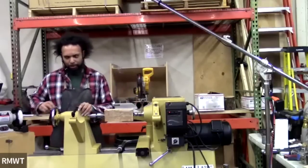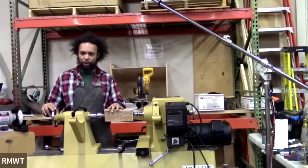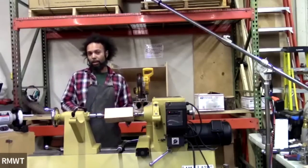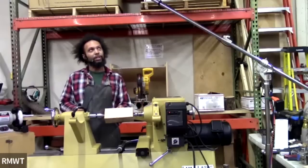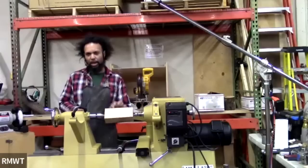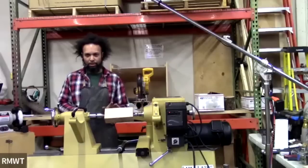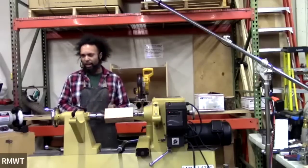And you say, well, what are you doing that for? Well, if you use an unsavory wood that's still a good material to work with, you're gauging your ability to make planing cuts correctly. If you can really clean the exterior of American elm that's green, because it's a very stringy, very soft fiber, even though it's a hardwood, I find that you can really gauge your ability to use the cuts. That is to say, how much pressure you're applying into it, and how light you should be.